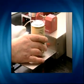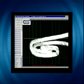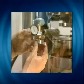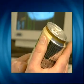Finished seams should be checked by complete teardown and sectioning method once every 8 hours for line speeds up to 1500 cans per minute and every 4 hours over 1500 cans per minute.